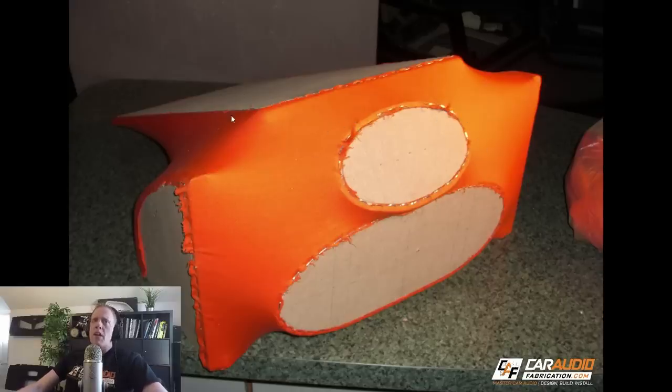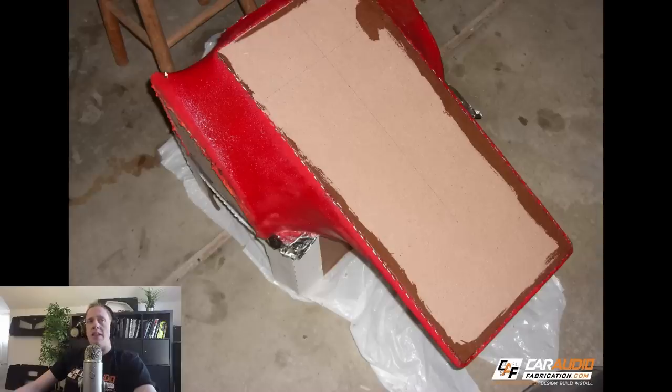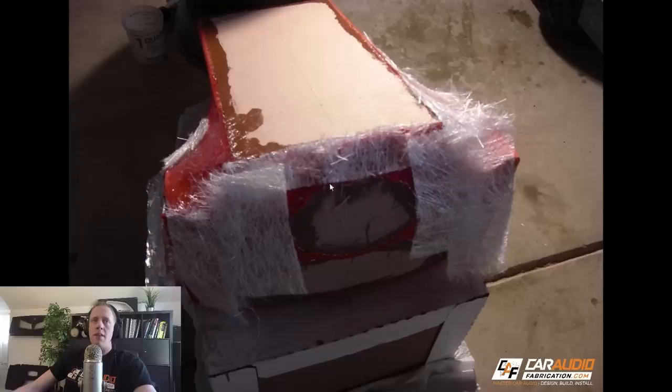I made the mistake of using a lot of staples. Because I didn't make the rabbited groove quite deep enough, those staples ended up biting me later - I was constantly having to sand through them, tearing through sandpaper. You could see them, they would pull themselves out and leave gouges in the body filler. Knowing what I know now, I would use CA glue to adhere the material instead. At least the areas with the rabbited grooves had a cleaner look, especially on those ellipse areas.